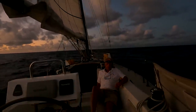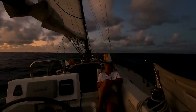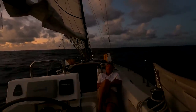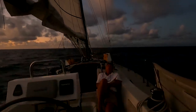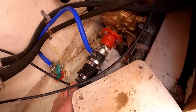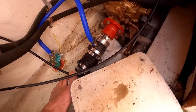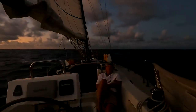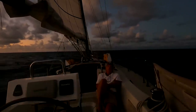So just burp it. But reality intervenes. If an air vent hose is chosen, if it happens to fall below the waterline, the boat can sink. That's happened half a dozen times, I'm told. So boatyards started installing water vent lines. They're safer in the long run, even though neither is strictly necessary for sailboats, if you can remember to burp them. Does that explain it? Maybe.